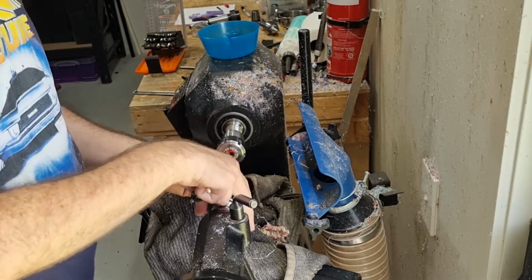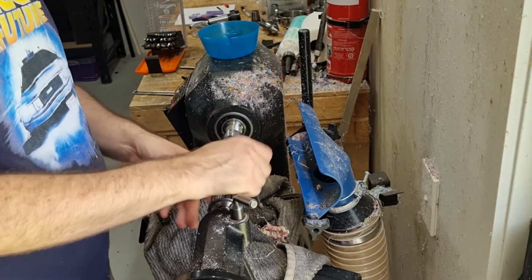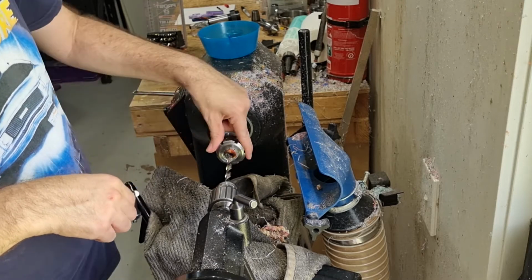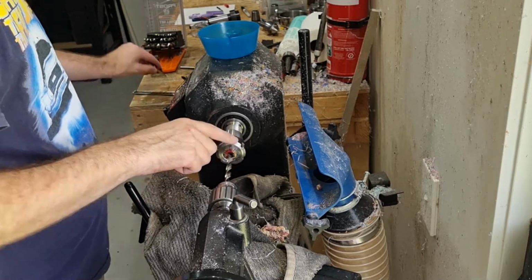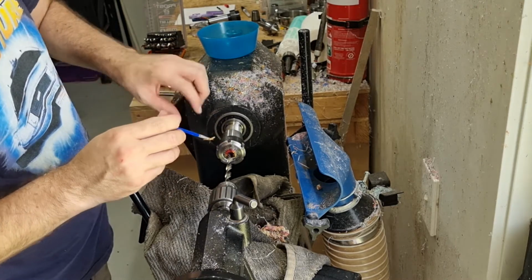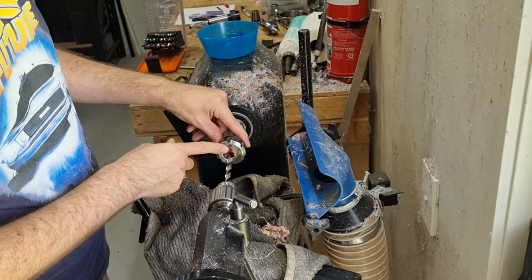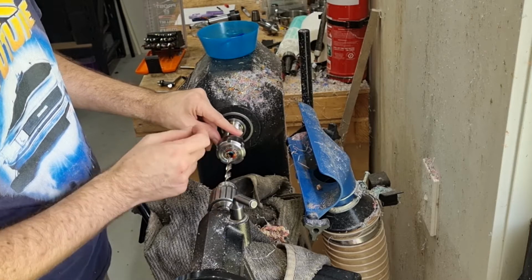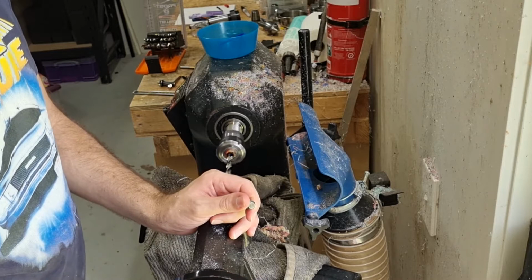The new Jowo housings that I've just gotten recently are a tenth of a millimeter bigger in all the dimensions. By doing it this way, I'm getting cleaner, crisper, more accurate cuts. So it is critical that you get this right. You don't want it to go too deep, because you want the nib to sit flush, but you don't want it recessed. But we also have to take into account that we'll be polishing this end bit and sanding it later, so we do need to have it go slightly further in than what it appears.